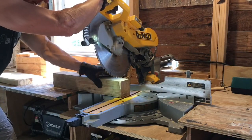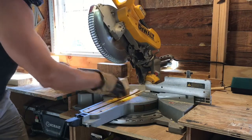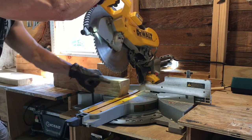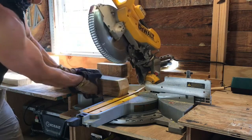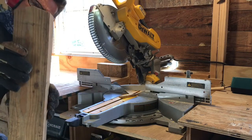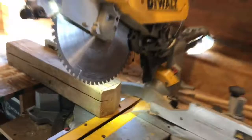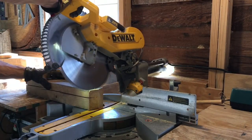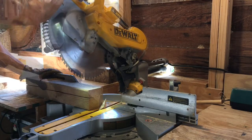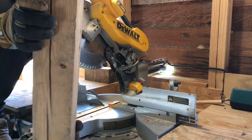I take a piece of four-by-four stock and just want to take a guess at about where the middle is going to be — I see the shadow there. My first cut: flip it over 180 degrees and try to put the shadow, or where the blade comes out, right at the middle — just kind of eyeball it. That's pretty close. Do the same thing here but line the shadow up right at the corner — that should put the cut in just about the right place. That's pretty darn good right there, and that's how you do it — that's your point.